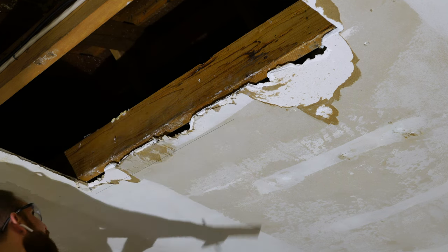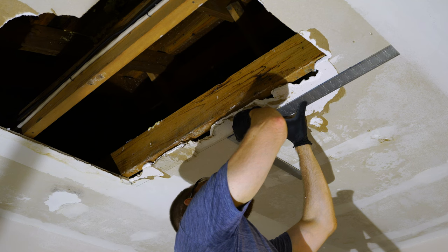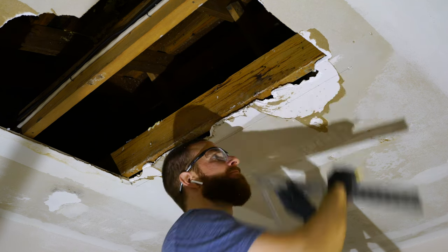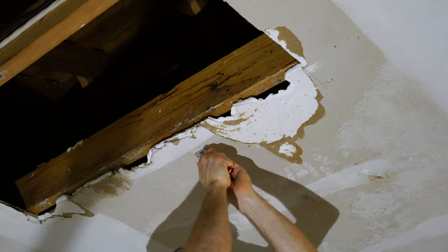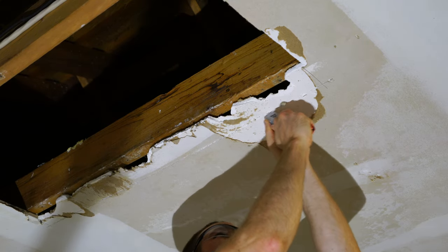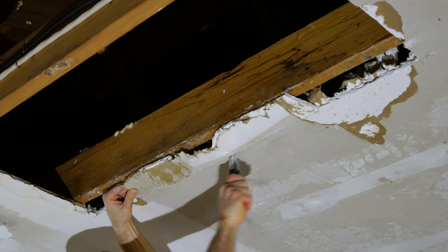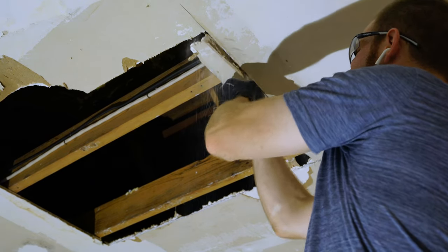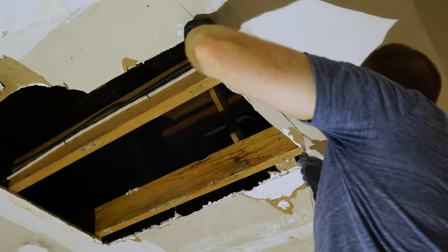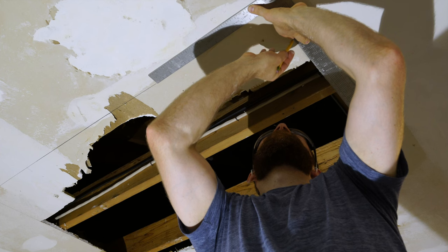If you're using this method, make sure you have perfect 90-degree angles in your corners and that your lines are straight with the joists. I'll be utilizing a razor blade to cut most of the drywall, however a drywall saw would also be a great option. When cutting the existing drywall, take your time and cut exactly on the line so that your new drywall fits in really well. You might not know which parts of the ceiling are structurally intact until you start cutting.